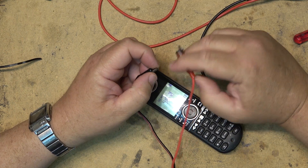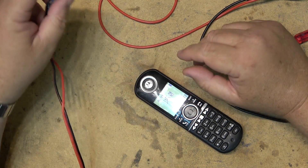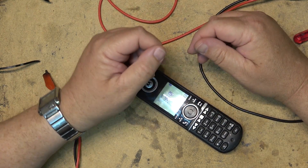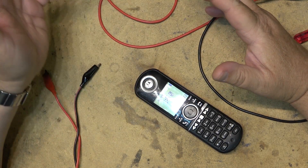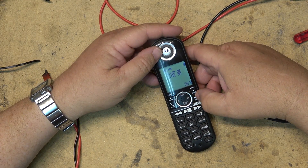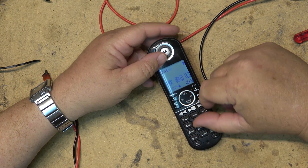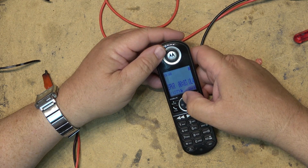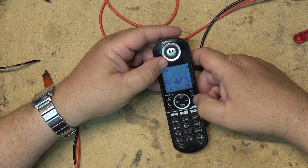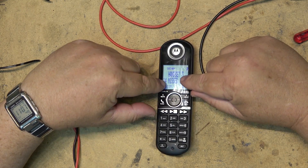The key when using a power supply — I used around six volts at five amps — is to keep the duration relatively short. Don't let the cell heat up. If you start to feel the cell heat up, immediately remove the power and allow it to cool. It only took a couple of minutes and as you can see this battery is now once again operational.